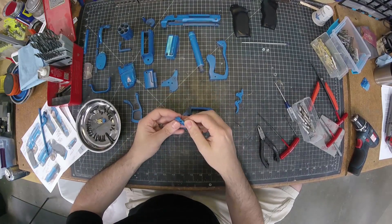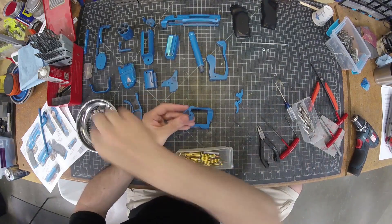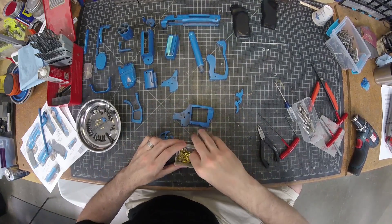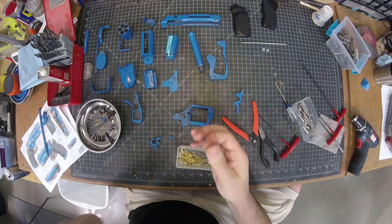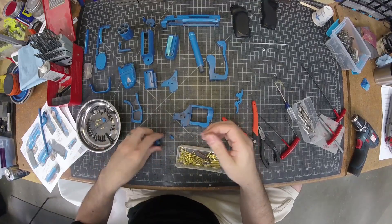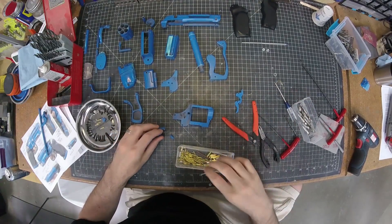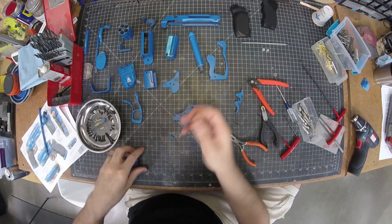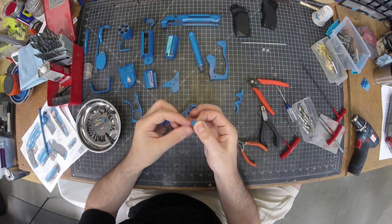There's this tiny little catch here that goes in like so and levers on a little axle. For the rods, I've linked to a bunch of assorted brass rods, but I use a really thin brass tube that fits right through there. If you can't find the right brass tube, when drilling out these holes use the 1/16 inch bit, drill the hole, then cut that off and just use that part as the pin.